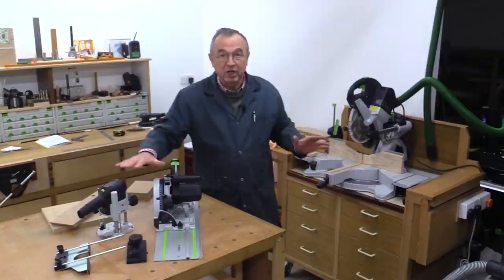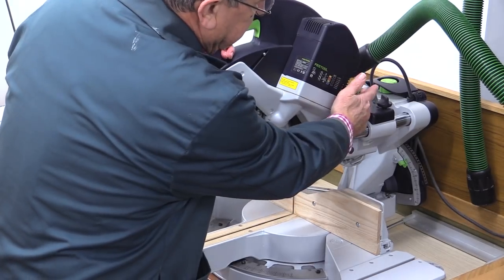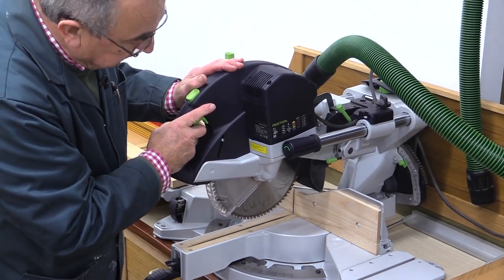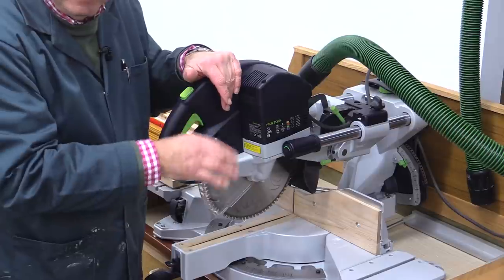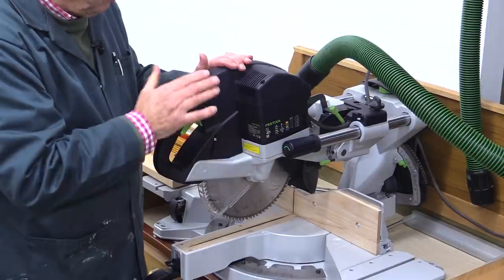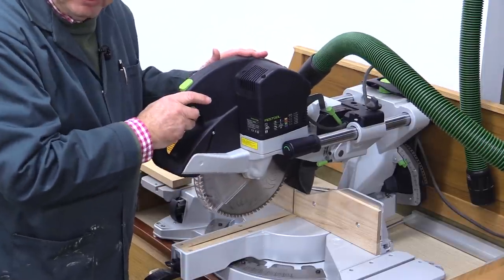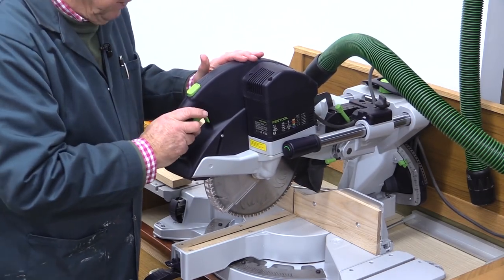On the Capex, there's a little lever here which engages the trenching mechanism. Once that's engaged, when I go down, it stops and can't be lowered any further. A lot of mitre saws when being used like this can give varying depths because of the different pressure the operator might exert on the saw at the end of its travel. With the Capex this is no exception — you do need to try and get a nice regular rhythm when you're doing trenching so that you get a nice even depth of cut.